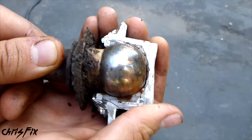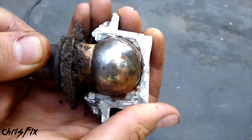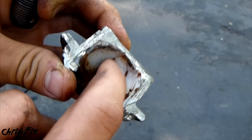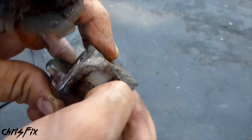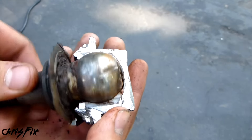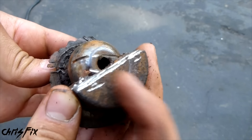You can see the upwards and downwards motion is just wear in the bushing. The plastic in the bushing actually doesn't seem too bad except down here — all that grit and stuff. There's not much grease in here; there should be grease. It's pre-greased from the factory, it's not greasable — there's no grease point or anything.